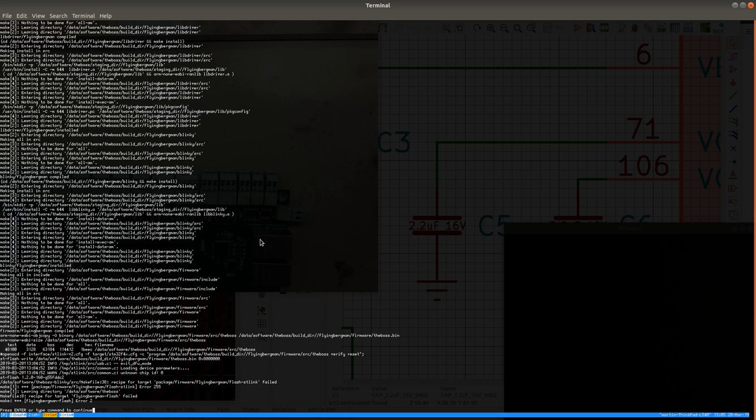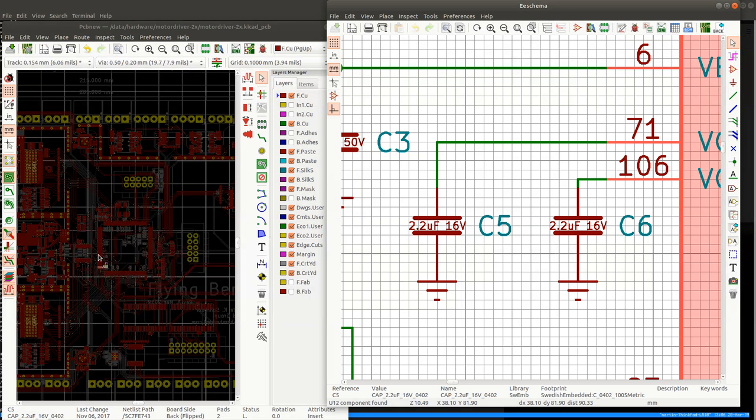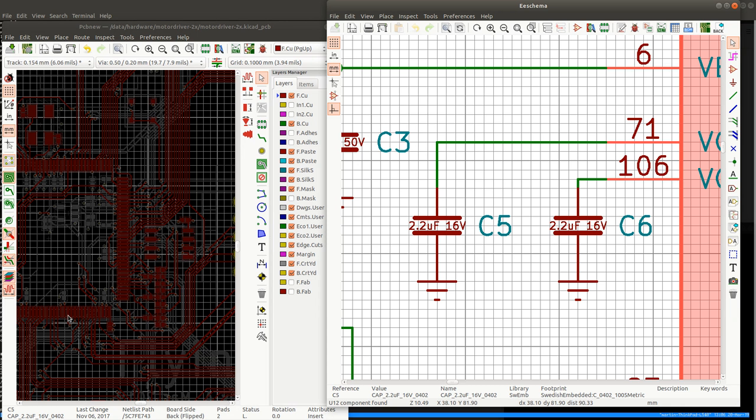And I'm gonna check if all of the ground connections to the chip are intact. And I may check more things that I come up with. But it's quite strange actually that it doesn't work, because there is not much here that could be broken, because it does have power. There is 3.3 volts going to it on all of the pins, which should have power. So the only thing I can think about is that it's probably not soldered on.